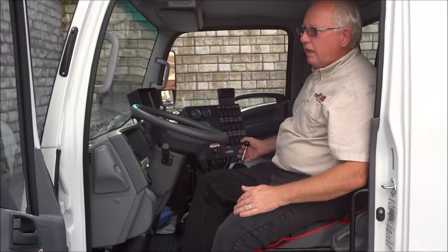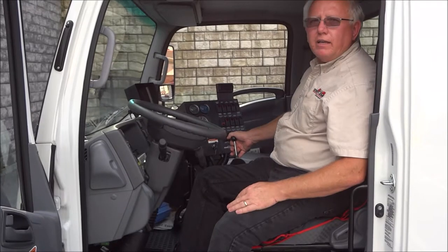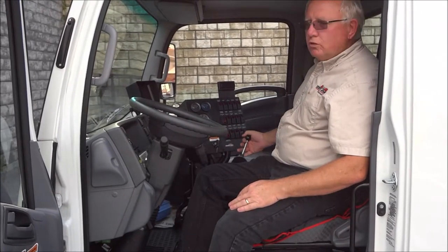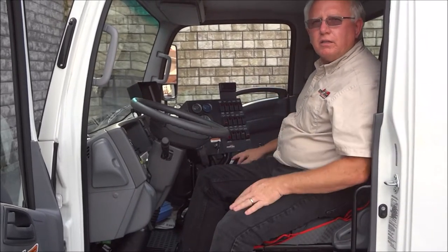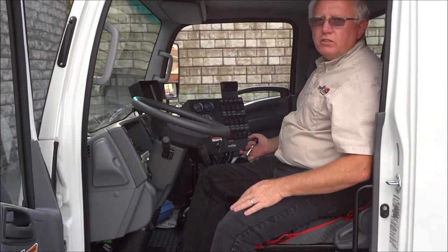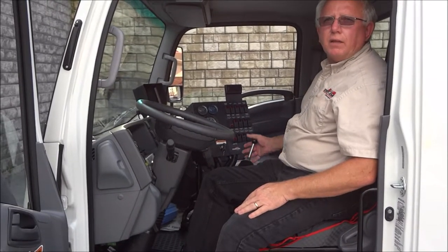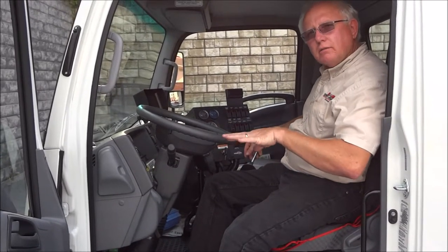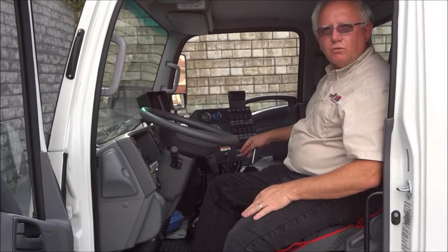You can actually see fairly clearly if your door is adjusted incorrectly. If it is too much closed, it will start blowing material out from underneath the pickup head. So you just open it up a little bit until the dust stops, and you just work on that edge where it is blowing dust out and not. That is where you want to keep it — it is constantly changing.